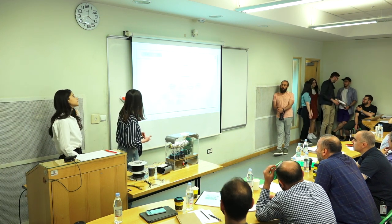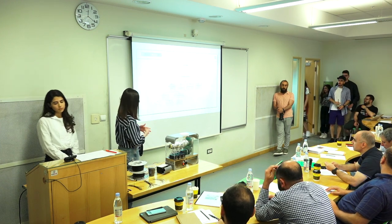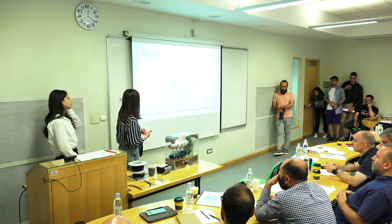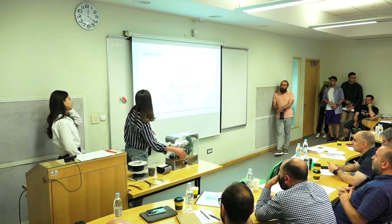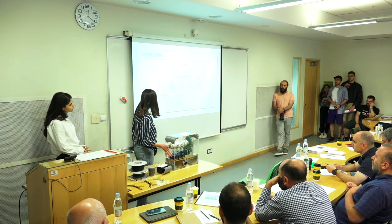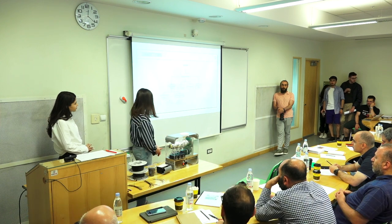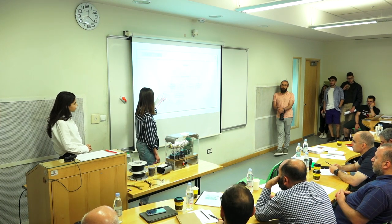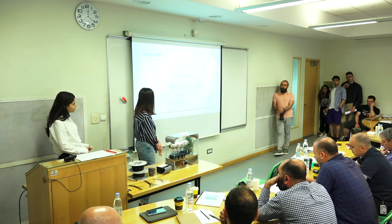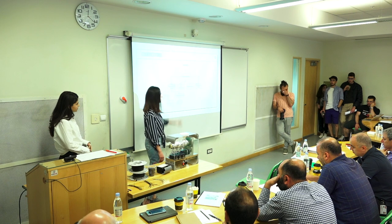Okay, so here we have a power diagram, which we did based on the power that each component is being supplied. So first we have the 220 volt AC power, which is supplied to the rocker switch here, and from there it is supplied to the 24 volt DC power supply, the three PID controllers, the band heaters, which are under the fiberglass, and the three solid state relays. And then the 24 volt is converted to 12 volt in the DC-DC converter and supplied to the Arduino Uno and the cross-flow fan. And also the NEMA 23 stepper motor is supplied 24 volt through the stepper driver.